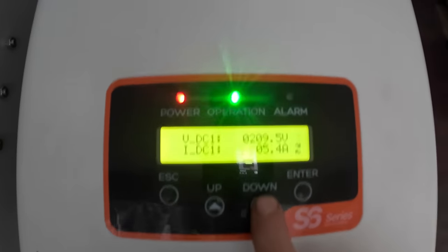If there's a power cut overnight, you wake up in the morning and it's not producing any electricity. Even if we put the grid back on, we remain latched off — we can't just switch straight back on. The process is: after a grid failure, you come out and reduce the flow rate so the wheel doesn't get too chaotic. The controller sees the grid is back on but we're still putting energy into the heater — you can smell it, it smells hot.